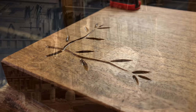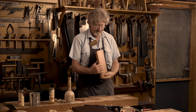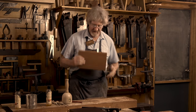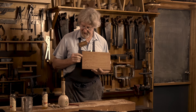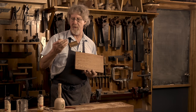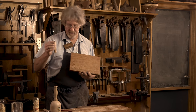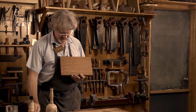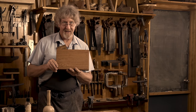It's looking pretty nice. So we've just taken a pretty ordinary rectangular piece of wood and turned it into a nice chopping board that stands out in the crowd because it's just got this really nice little embellishment. So simple. All done. I did this with one tool — that was the 4mm V tool. If I use the 6mm one, I could have gone bigger and deeper and made wider leaves. But I was just doing something small because it's a small board. Nice little trick, hey?